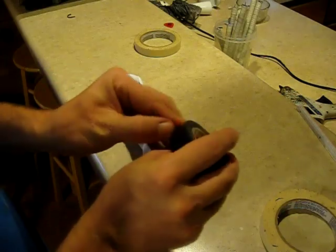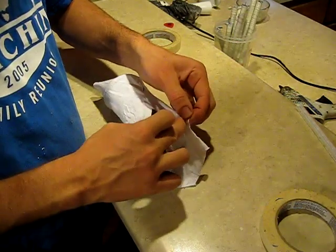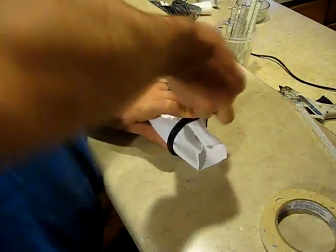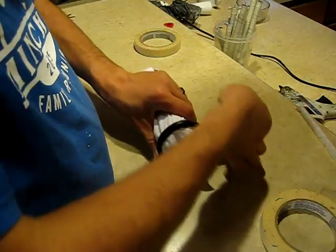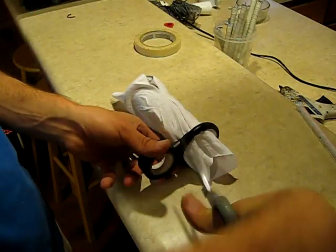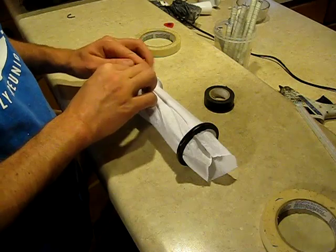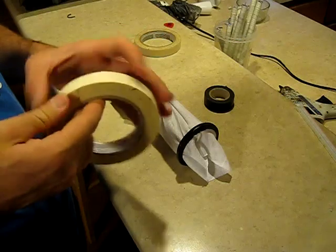I'm going to use black electrical tape on the plate portion. I do have a reason that I'm leaving the cotton coming up all the way over the plates — so that moisture can get into the inner primary coil windings if you need to wet this down again. It'll travel up through this exposed cotton through capillary action and then down into the primary part of the coil.